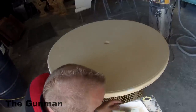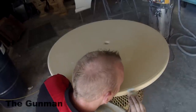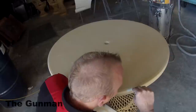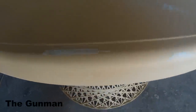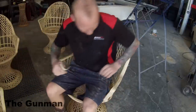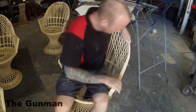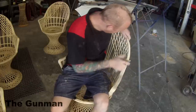Taking time just to wipe it right in so there's going to be enough in there, but not too much that it'll take forever to sand out. If you put it in too quickly you might sand it out and find it's not quite enough, and have to reapply anyway. So you may as well just take that couple of extra minutes to get it right the first time. Just going over all of these chairs as well.